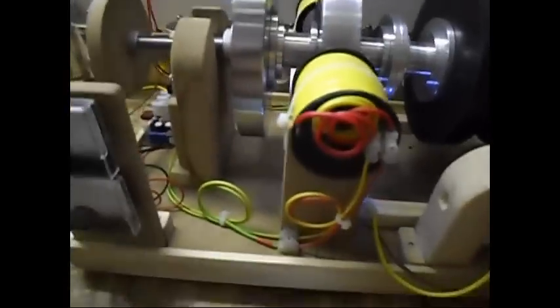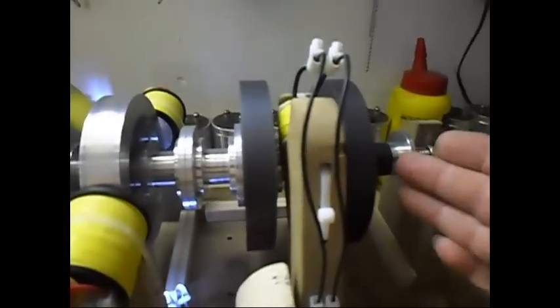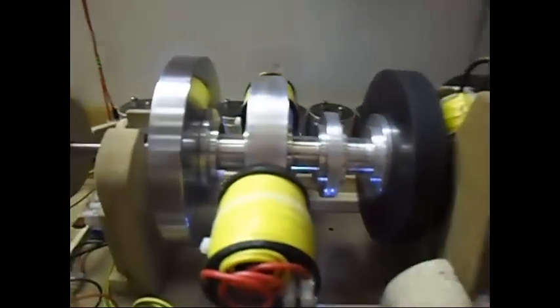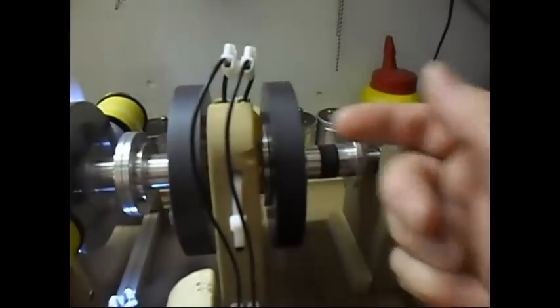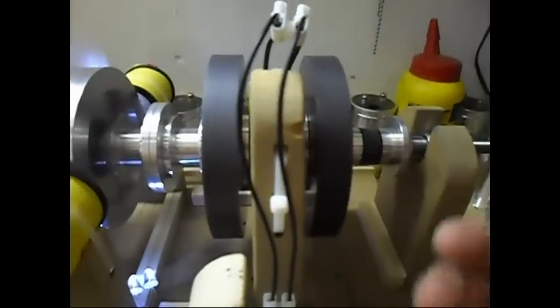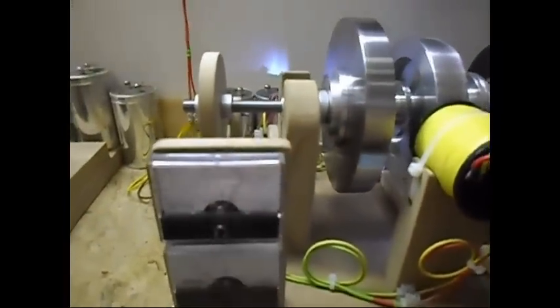The reason for that is that driving it on 26 volts, because of the inertia and the momentum these two ring magnets are giving, the system wants to drive around 2100 RPM. But these rings are not perfectly balanced, so I get a lot of vibration once the speed gets up to 2000 RPM. That's the reason I'm driving it 3 volts lower.